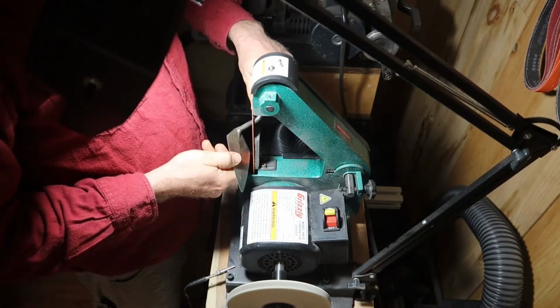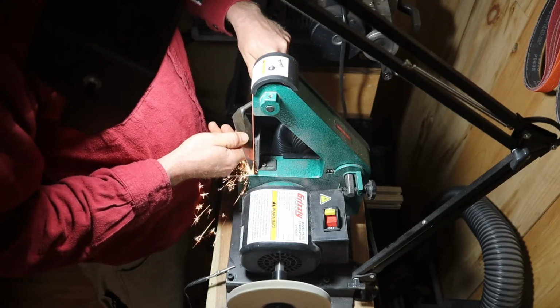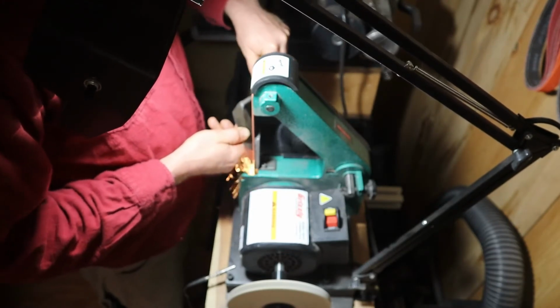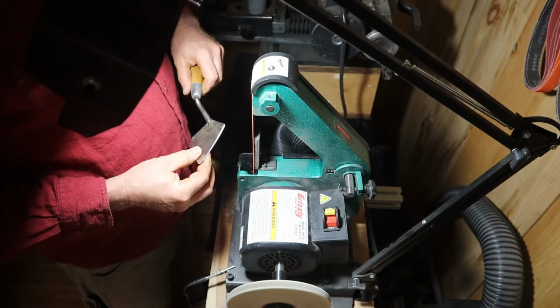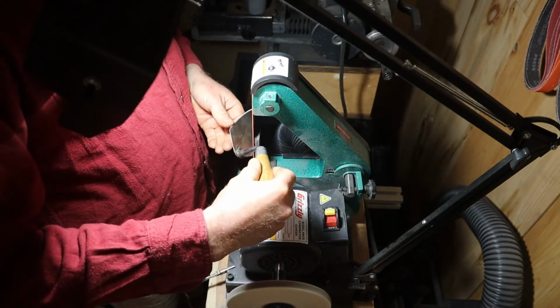And grinding, I don't know if you saw me just check there with my finger, checking for the burr, but a moderate amount of pressure, got to get some material off. My hand is on it, I'm monitoring the heat, checking for a burr, and we got a burr. Now let's just make them look good, right?